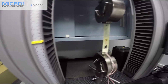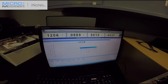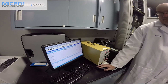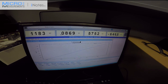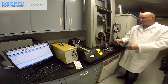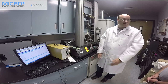We're going to stop the test at about 1,200 pounds to see what value we're getting. The strain will continue to display and you can see some relaxation in the specimen — the load stays at roughly 1,200 pounds but the strain readings relax a little, which is normal for this product. Looking at the stress-strain curve and the Poisson's ratio already displayed on screen, it's 0.1465, which is within the range we were expecting. For repeat testing, with the amplifiers already preset, you just connect a new specimen, trim everything out, take the zeros, and restart — you can test several specimens fairly rapidly.